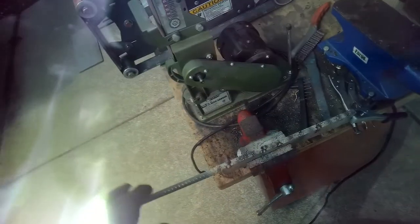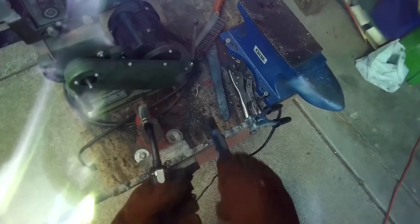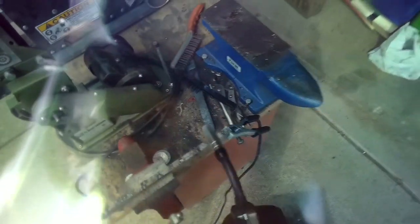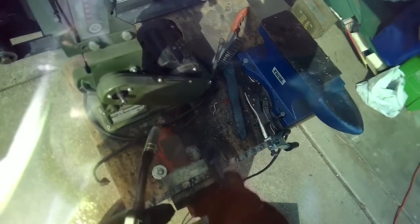Let's see if that holds together in the forge — this stick is on there pretty good. On an area you want to weld, you're going to get some oxidation and spatter, but you can use your wire brush from the kit to clean it up first and you'll get a better weld. Just take a little more time, get hotter — that's a pretty good bead. The straight line is binding all four layers of metal together, so that's good. Let's try that here too — same concept, clean it up first, get it shiny. This is all in preparation to do Damascus.